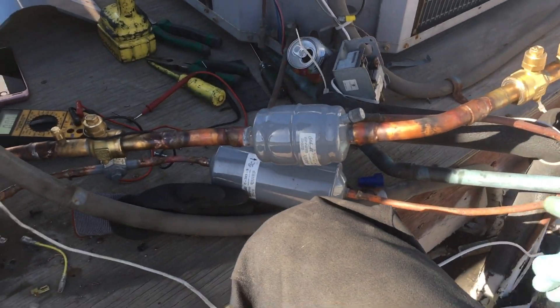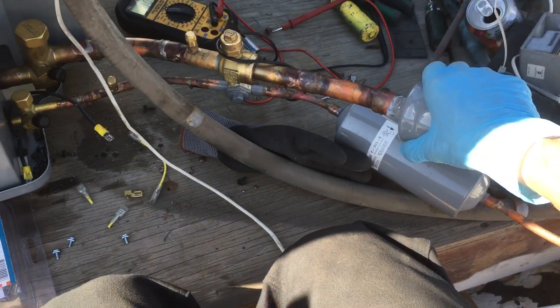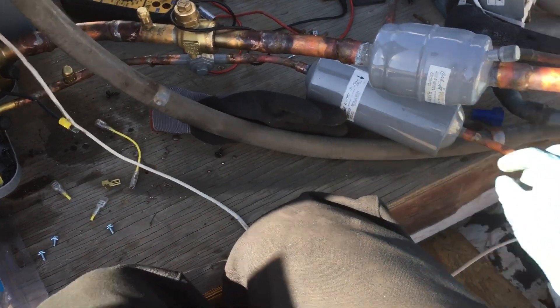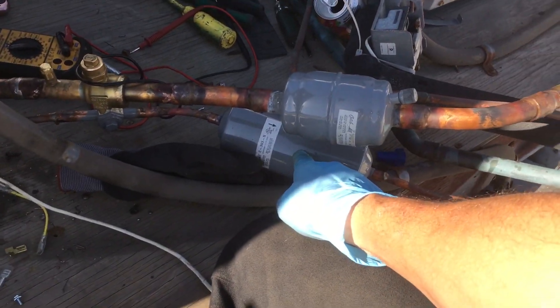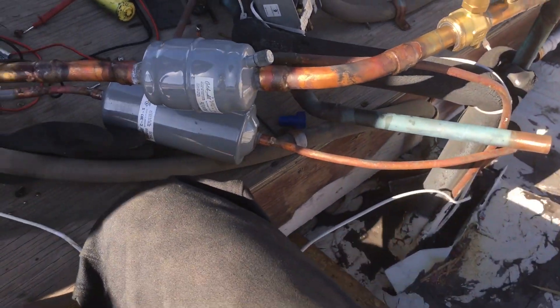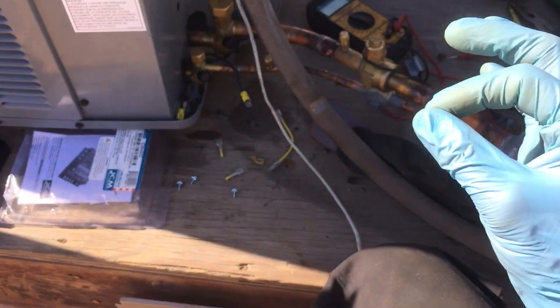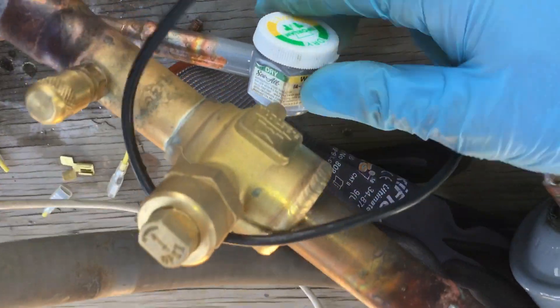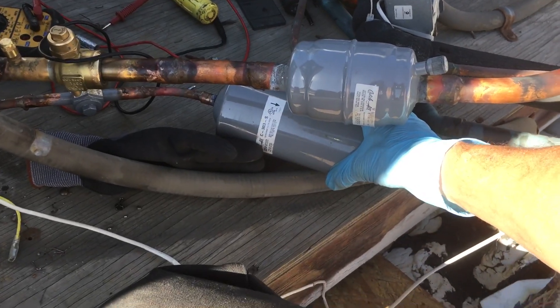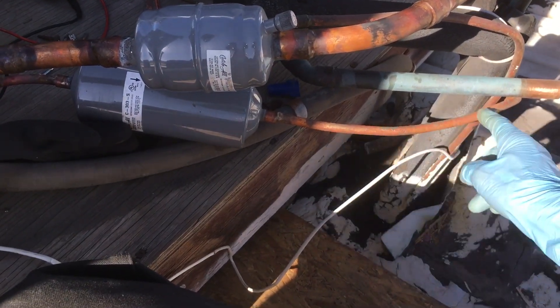I'll probably see you next time either when I recover the refrigerant and take out the dryers from the cleanup. Look at this — nice and crystal clear right here. When we first filled this up by line set length, there was a little flashing in the sight glass. Look at this big filter right here — imagine how many feet of 3/8 liquid line set it takes to fill this filter. Even if you correctly charged it at, say, 0.6 ounces per foot of 3/8 line and did everything correctly, you should have a solid column of liquid with no flashing at the sight glass.